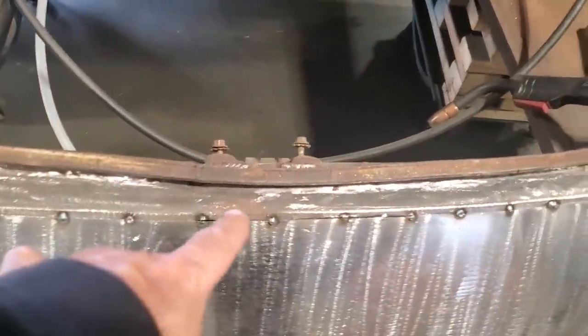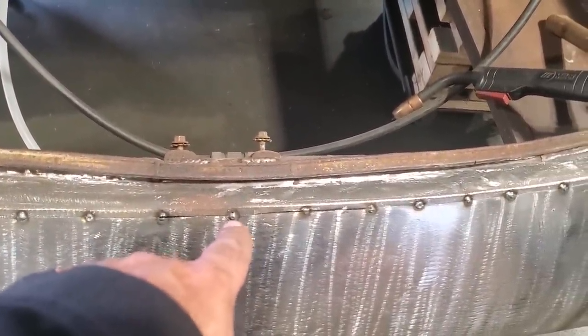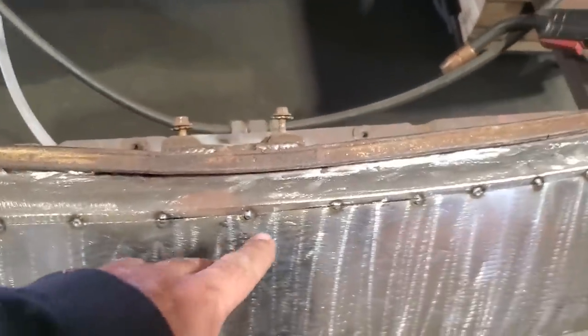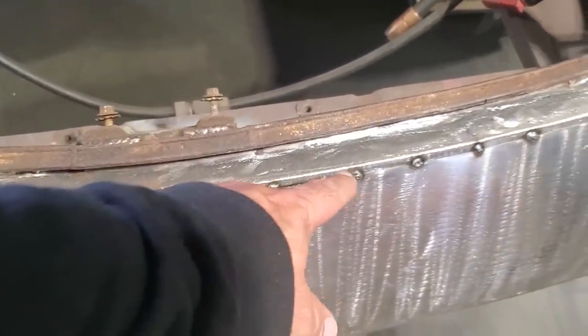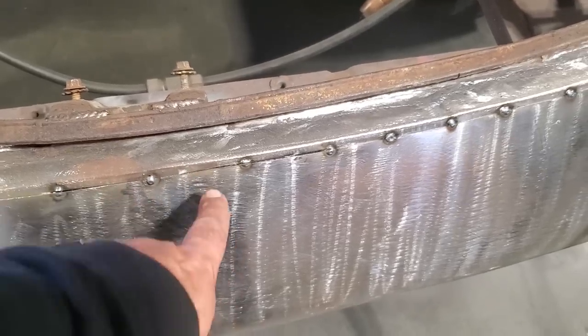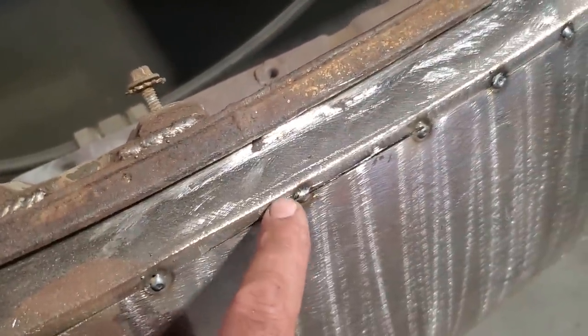Stop here because I want to show you. You saw me cutting in the middle, then pushing in with it and spot welding that spot there. So that went flush right there, okay? So that's nice and flush. Now, when I started to cut away from this, because I pushed this down, this metal here is wanting to pull inboard. So now if you look, I cut across here. This is flush, look. Okay?